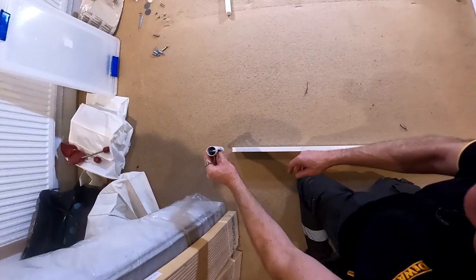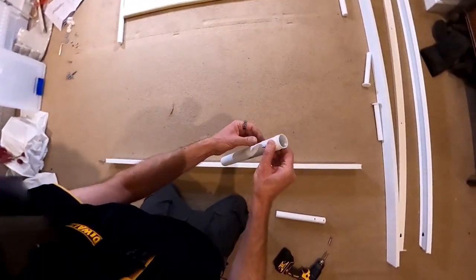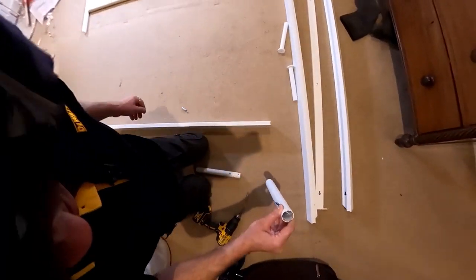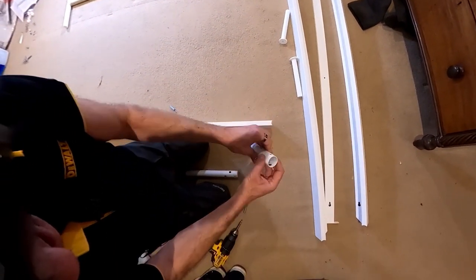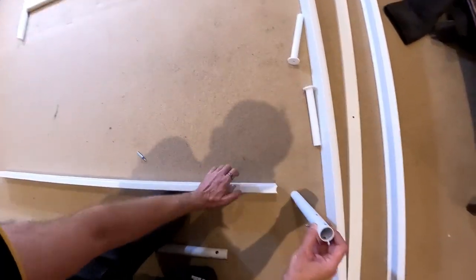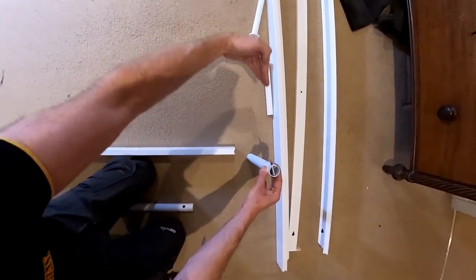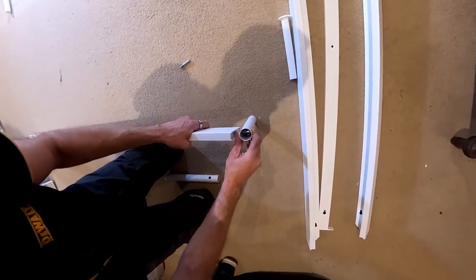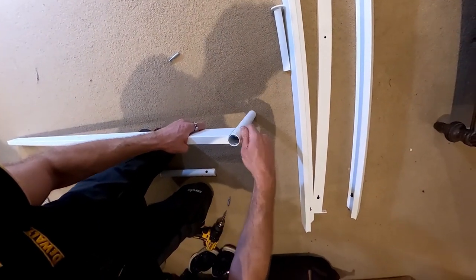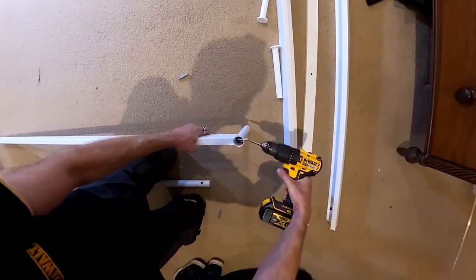Now, if you install it like this, they'll be the wrong way around. It is side dependent, and this one wants to go on this side. That will allow you to have two larger holes there, which will leave these two smaller holes ready for the bolts to go through like that into the side support. So it's really critical to be really careful assembling this section. Do it up to a torque of about 10.